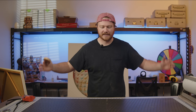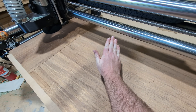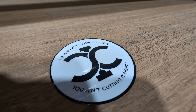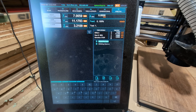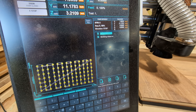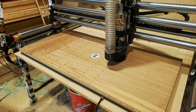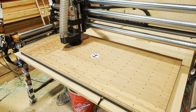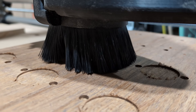I wanted to cut out a ton of them using the entirety of this piece and I did have some brand new material in the shop that I absolutely love. It is called Bamcore and it's from CIC Workshop — the really cool part about it is it is pure bamboo. So I went ahead and took a two by three sheet and then a one by two sheet and put them all over the top so that I could make the entire field to cut out all of our pieces. Now normally I absolutely love making sure that the profile cut goes all the way through — I do not like onion skinning. I think that creates more work and if you're buying a system like this you really want it creating less work, not just different work. So I wanted to show that you could profile cut all the way through with these, every single one of the 91.